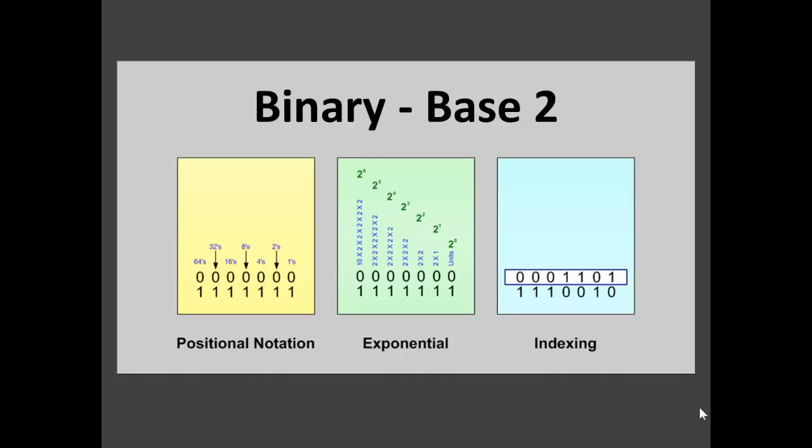Now here's an interesting point. Notice that the exponent on the base 2 number system goes beyond 2 characters. In the binary number system, there are only 2 characters, 0 and 1. There is not a 2. 2 is not part of the binary number system. It's zeros and ones. If you get 2 clicks on the least significant digit, then the next position goes to 1. There isn't really a name for any of these positions. We typically say 1, 2, 4, 8, 16, 32, 64, times 2 is 128, 256, 512, 1,024, 2,048, 4,096, 8,192, 16,384, and so on.